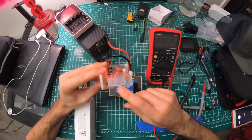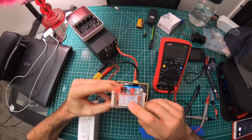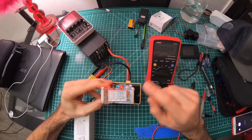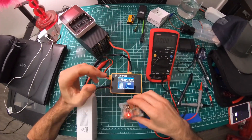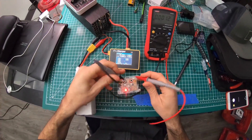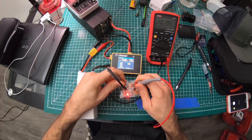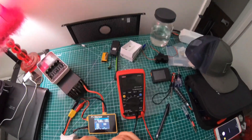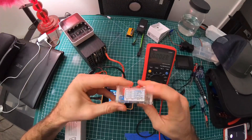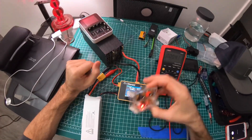As you can see, it's set at five volts. It reads 5.0015, and since this digital multimeter only reads four and a half digits, it comes out at 5.001. So it's spot on — this digital multimeter is spot on right now.